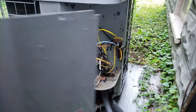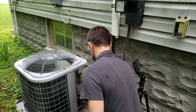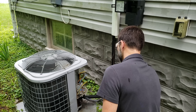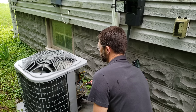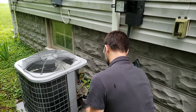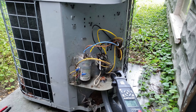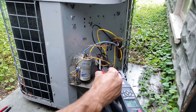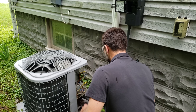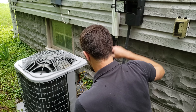We remove the electrical panel to look inside, then push the disconnect back in to apply power to the outdoor unit. We don't have 24 volts from the indoor unit, so I press in on the contactor manually. The condenser fan turns on but the compressor does not. Taking an amp draw, we measure about 63 amps until the compressor overload protector opens up, then only about 0.8 amps for the condenser fan motor — the compressor is not starting.